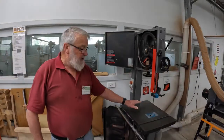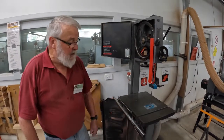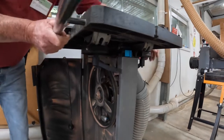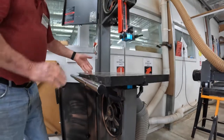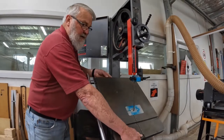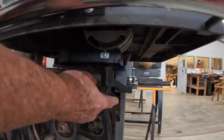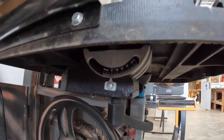The table can tilt to 45 degrees, lifting that way, and I'm about to demonstrate that. To unlock it, there are two screws underneath — one at the front of the table, one at the back — which only need a half turn or thereabouts. Then you lift from the rear, or lift from the left side as you're facing the saw and push with the right, and the table will tilt. Underneath there is an angle guide for where the table is sitting, so that you can make angled cuts.